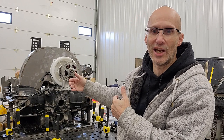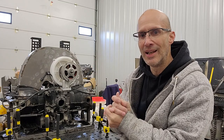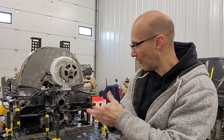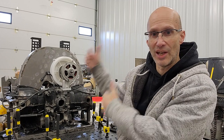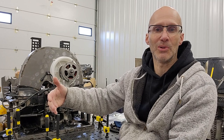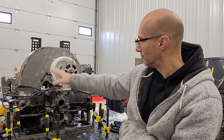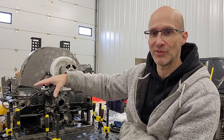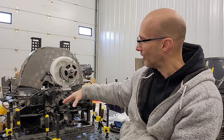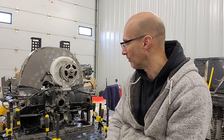Figuring out exactly how to measure the front side is a difficulty, so right now I've got a way to mathematically estimate it. The measurement from just the backside fan is actually significantly higher than even my next generation fan with a velocity stack on that backside. And in that estimation, the overall fan shroud is actually flowing more air with this approach versus the Evolution 1 with the single larger fan. So this will be another option for people to get even more cooling, while still fitting exactly the same way using all the same components.